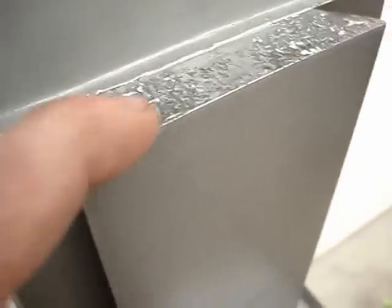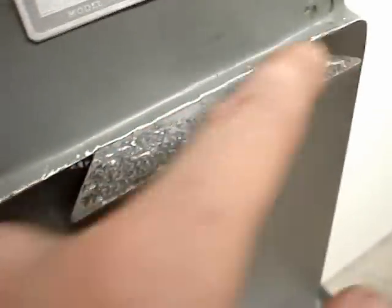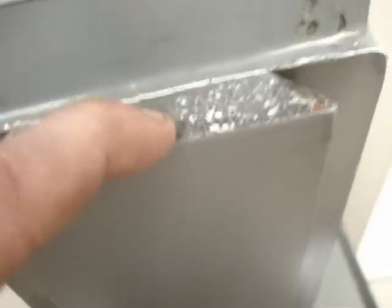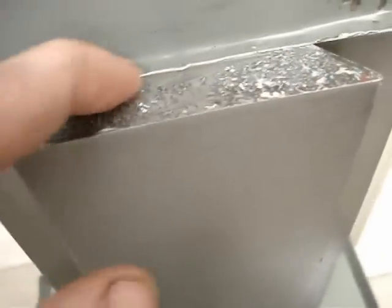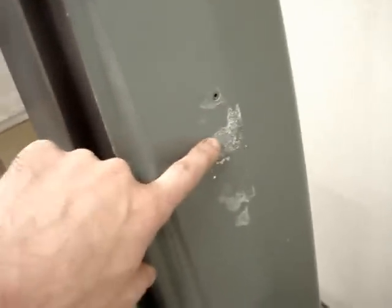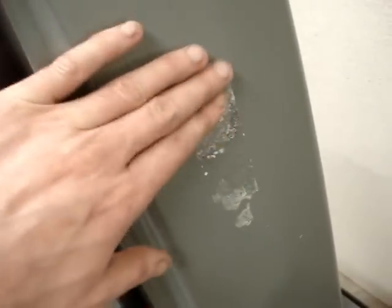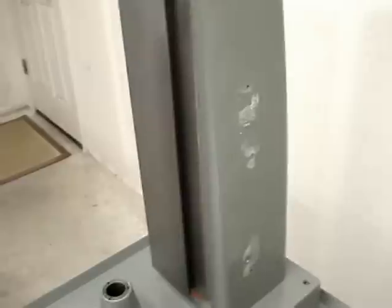You can also see it up here. I'm going to file this down and make it a bit smoother. When I took the paint off in this rough area of the casting at the end of the dovetail, there was quite a bit of body filler that I chipped away. You can see where I accidentally hit the edge of the dovetail on the knee — there's body filler or primer there to smooth things out. Over on this side the paint underneath the plaque had actually rippled up, so I took a sharp knife and relieved the wrinkly areas.